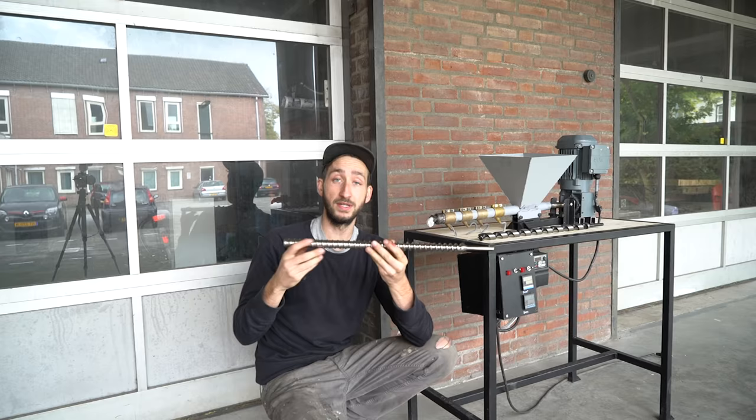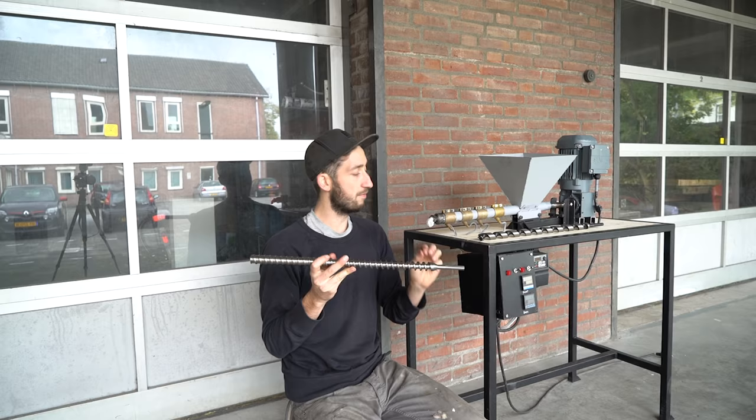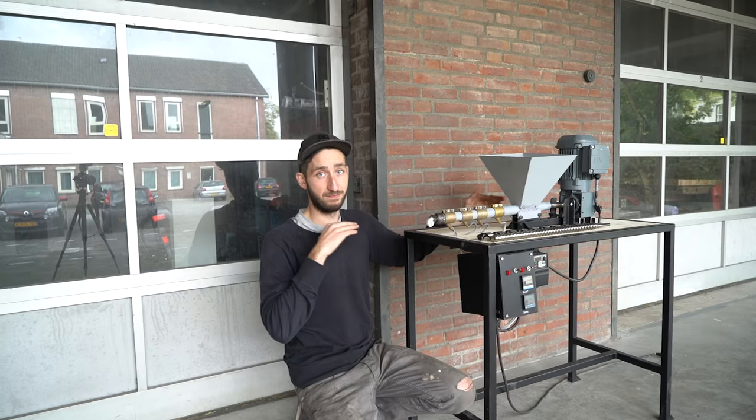You can download the technical drawings of this screw yourself so you can make it, or go to our online bazaar to see if you can get one. Special thanks to our community member Seaman for making the technical drawing. You could just swap this extrusion screw for the original one and you're done. However this builds a lot of pressure, which means more force on your machine, so you want to do a few other things. You definitely need to increase the strength of your machine — mainly the barrel holder needs to be reinforced. Get a more powerful motor and make sure the table or plate it sits on doesn't bend. We installed some metal tubes underneath to make sure it stays flat. The rest can pretty much stay the same, and once you reinforce your machine and put in the screw you're ready to extrude.